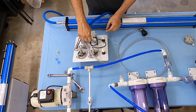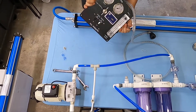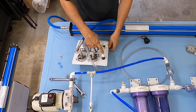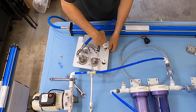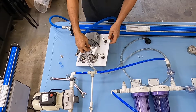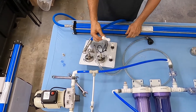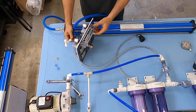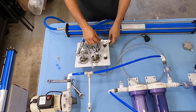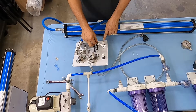The other connection here is the TDS analyzer, which is also on the control panel. The fresh water runs through this T before or after the flow meter — it doesn't matter where you put it. This analyzes the water up to 600 parts per million; if it's below that, you can drink it. There is no need for a diverter valve because this is a real-time analyzer that analyzes the water continuously as we produce water.